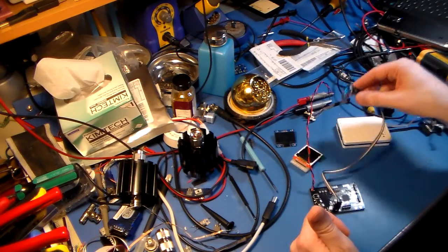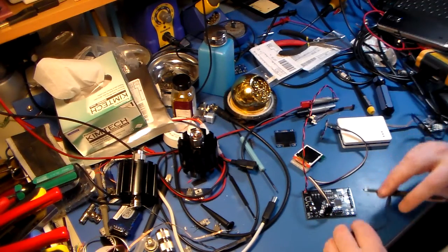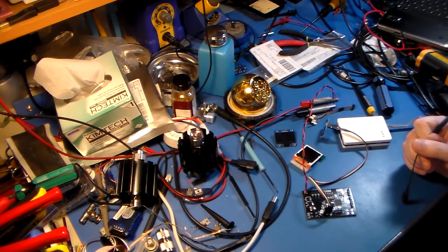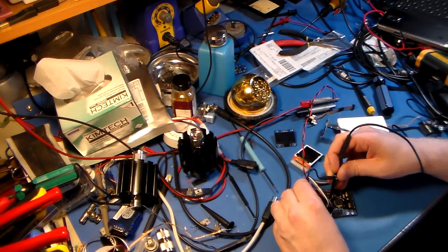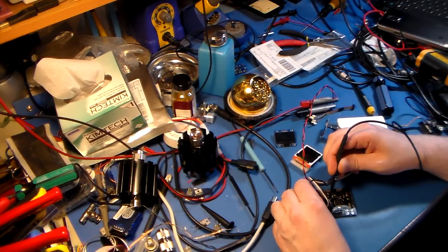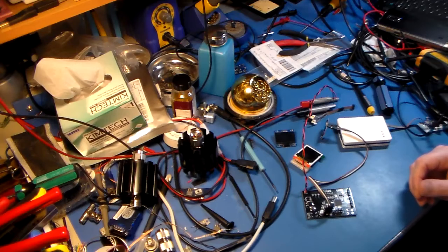You calibrate it right on the screen. So you know, there's nothing to tweak on that, because that oscillator. See if I can't measure what the output of that oscillator is. Which pin is it that's the output? Number 3. So that's going to be this corner, if I can measure it. The crystal, or the TCXO output is 25.000019. So this thing is 19 hertz out. You can't complain. I mean, that's within its spec. So, you know.